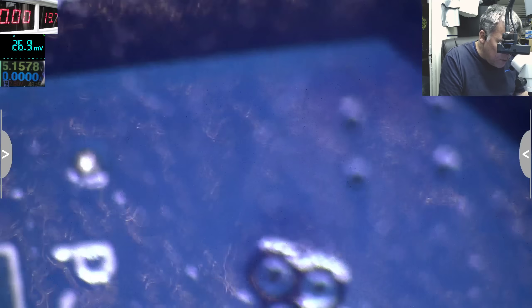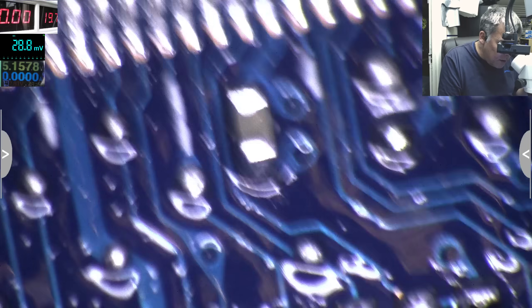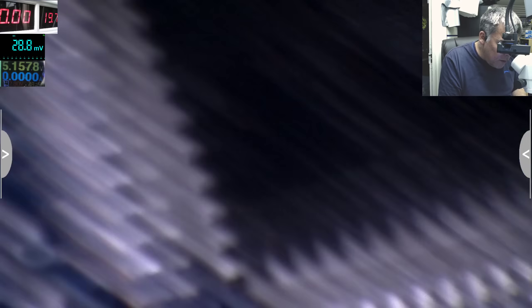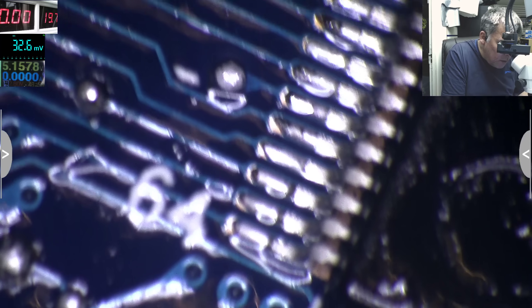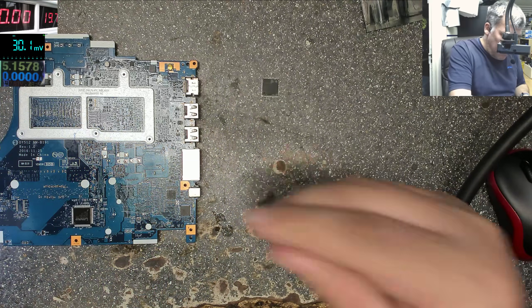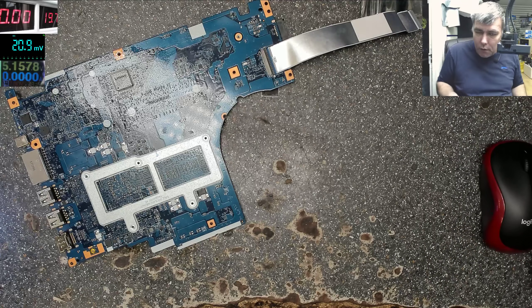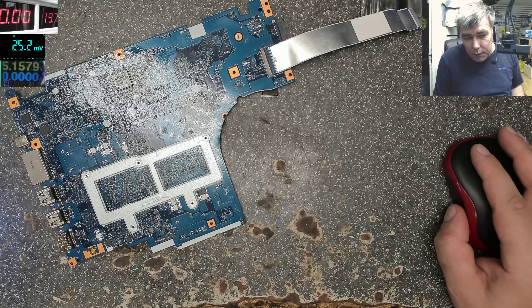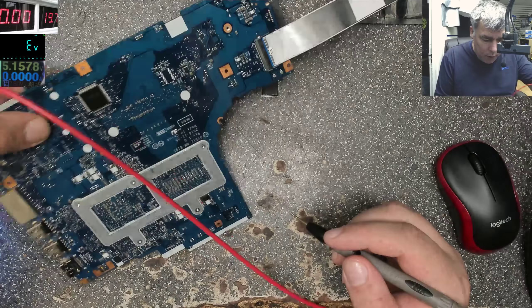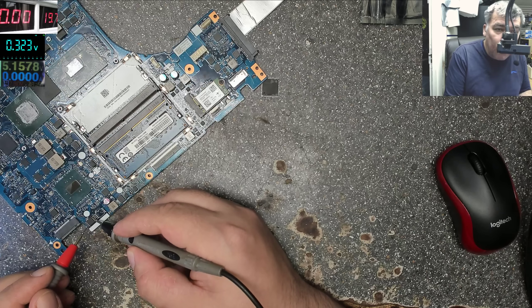The problem is because it's a recording and there's a camera, you can't really see the solder joints, but I can see them very very clearly. Yeah, it all seems to be fine. If we are not fine, we'll resolder manually, but hopefully it will work. Do we have a short anymore? Let's see — multimeter in diode mode, on the BIOS pin number 4 and pin number 8. And we have no short.